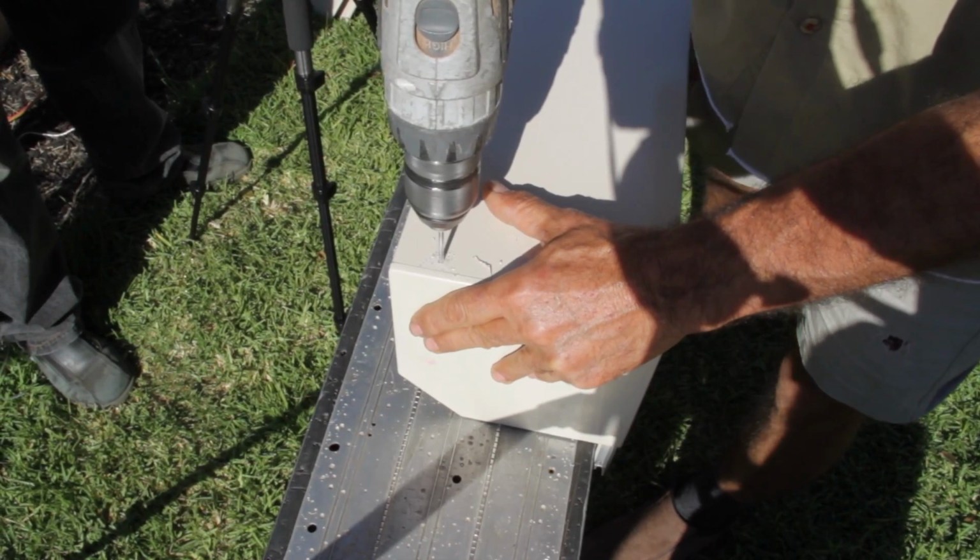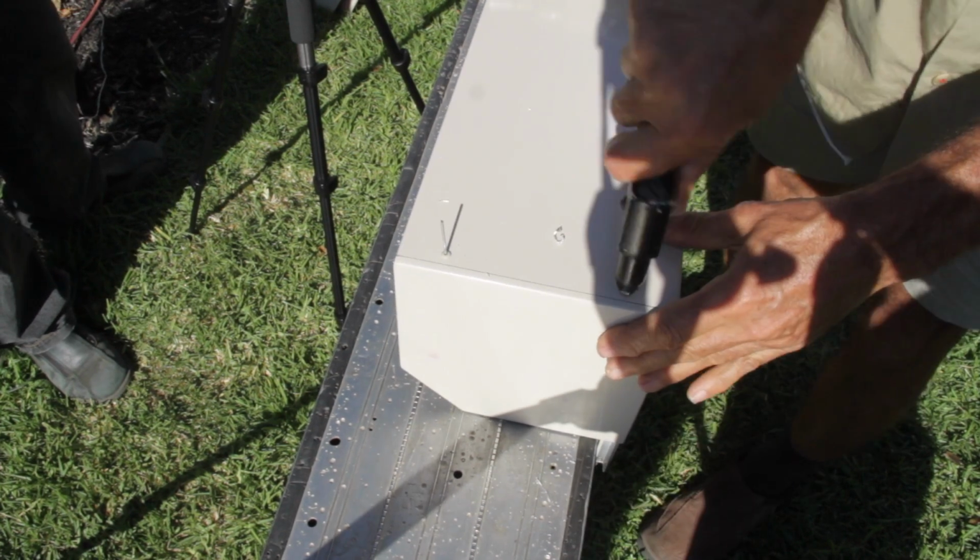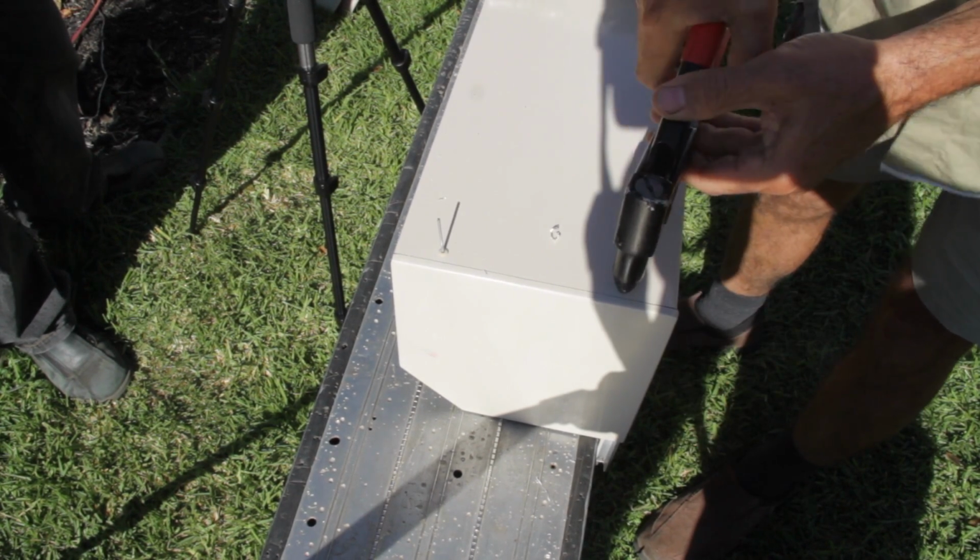Again, using your drill bit, make 2 holes on the top of the headbox and then rivet end plates into position. Also, do the same on the rear of the shutter on one location at either end.